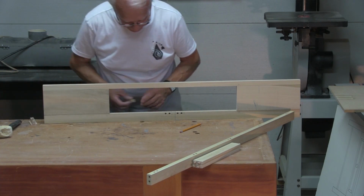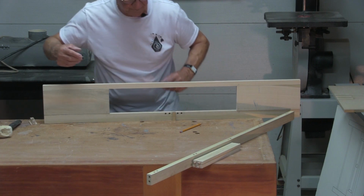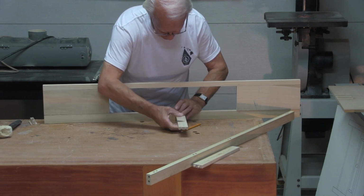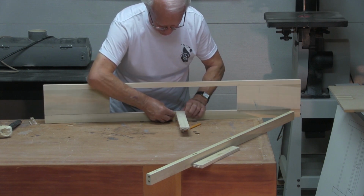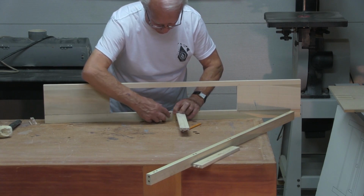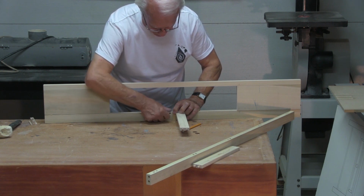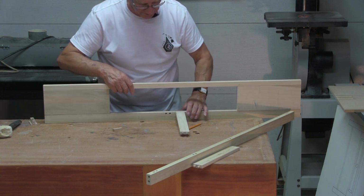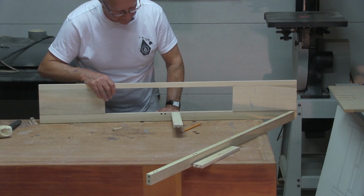Then what I do is I use this here, which represents the width. I put Dowelmax in. I actually fit one of these in. That will have been finished. Then I put the spacer in here. Then I know you're exactly right. Bring Dowelmax up and touch it here with the 1/8 of an inch spacer, and that'll bring you down to the center of the 1/2 inch wood and make this all flush here. Bring Dowelmax up there in the second configuration, and drill 2 holes. And they do exactly the same at the rear end, and the whole system works really efficiently.